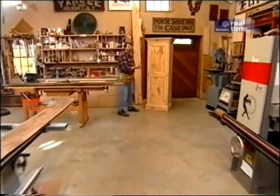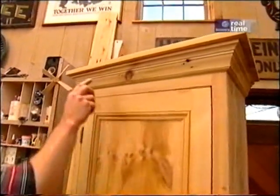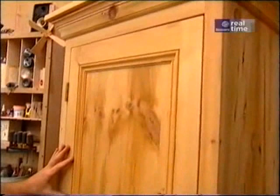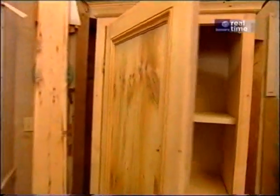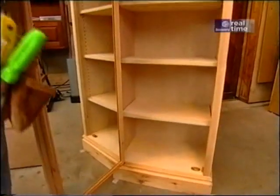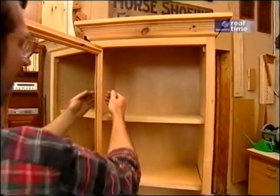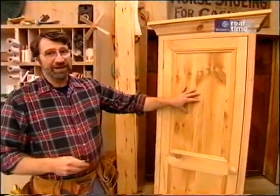I wonder how much Ed will give us for our version of the bathroom cupboard. Here it is with a few changes from that antique we saw. I thought the top of Ed's piece was a little too plain, so I added this cornice molding. The door is exactly the same — I had some knives cut to make these moldings on our new molding machine, which I'll show you later. On the inside, I added a full-length mirror held in place with a wooden frame, and I set up a series of adjustable shelves rather than fixed shelves. Ed's piece had old pine boards exposed on the inside, and I'm afraid that would catch fine linens or clothing, so I lined the inside of the cabinet with some birch plywood, which can be painted or just have a clear coat put on it.